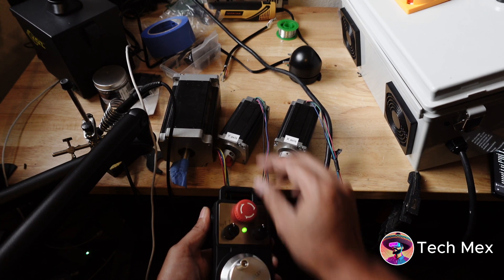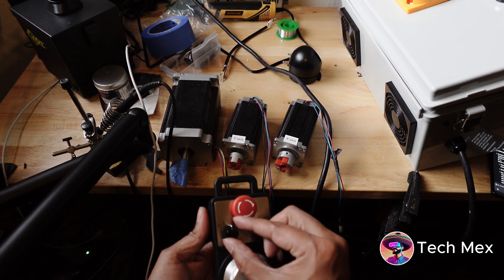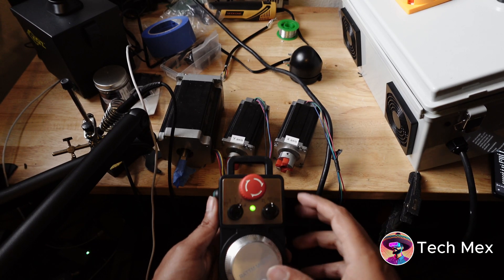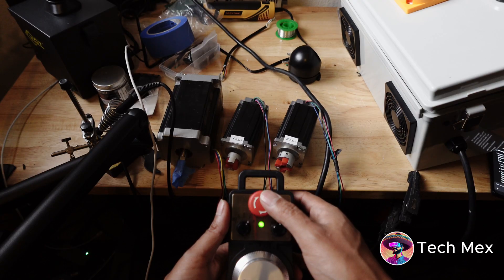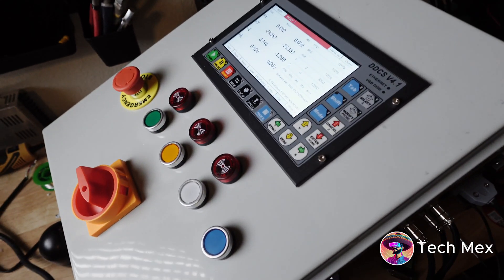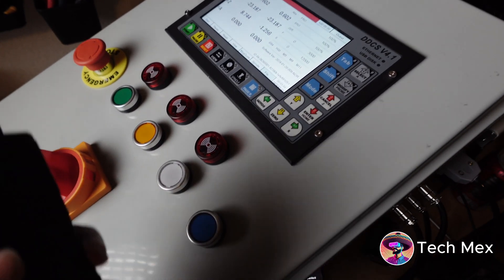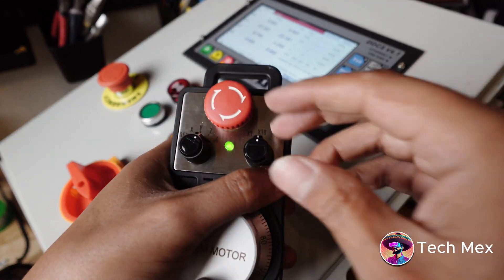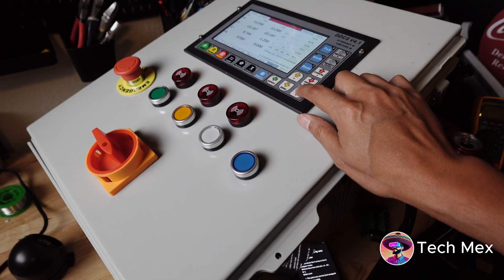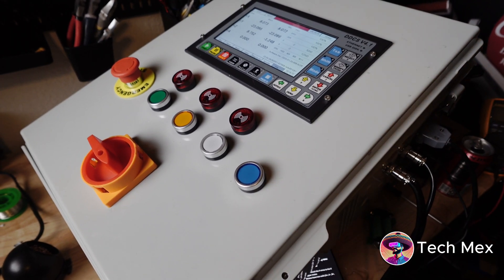Here is the MPG — you select the axis, press the green button on the side to enable it, and you can configure each increment down to 0.001 inches (one thou), which is pretty awesome. It also has an emergency stop. I was able to test all three axes: X, Y, and Z. Testing the emergency stop: you pop it up, the controller displays a reset prompt, you manually reset the machine by pressing the button, and then it re-engages. Thanks for watching — all axes are working!